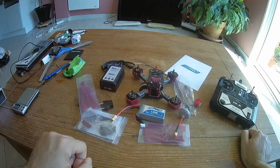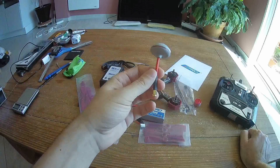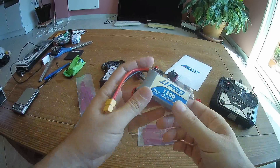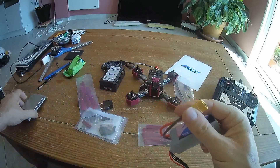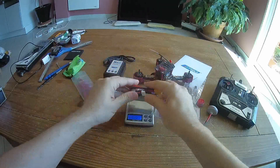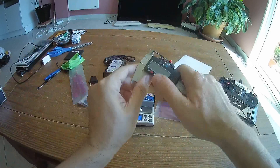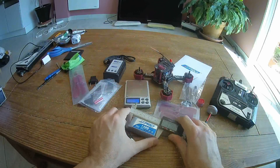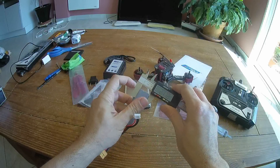Here is the content of all the elements of the GJC P175 Pro. I also forgot to mention the presence of a cloverleaf antenna for the FPV rig. First of all, let's start with the LiPo. It's a 1,300mAh with a discharge rate of 30C, ending with an XT60 connector. The weight is 122 grams. If you are looking for a replacement, it's 71 by 35 by 22 millimeters.